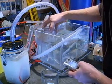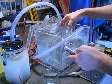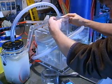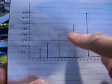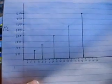Okay, nearly there. It's sitting on 16 and a half amps. And that's it. So, 16 and a half amps gave us exactly 400 millilitres. I've put our data into a grid — across the bottom we've got different amps, and here we've got millilitres. There's a straight line running through the first four data points, and all of them seem to be sitting right on that same line. This last one is performing a bit better. That's some interesting stuff that I'll have to think about a bit more.